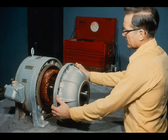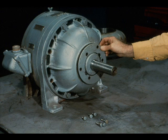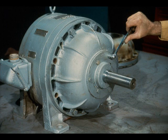With the rotor in place, the next step is to install the end bell on the inboard end of the motor housing, as shown. Tighten the cap screws securely, using the crossover method to prevent tilting of the end bell on the housing. Now, the inboard end plate is replaced. This end plate holds the bearing cartridge in position by securing it to the end bell. First, install the cap screws in the inner circle — these fasten the bearing cartridge to the end plate. Then install the cap screws in the outer circle on the end plate, which fastens the end plate to the end bell and positions the bearing cartridge.